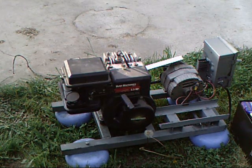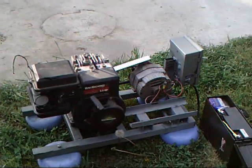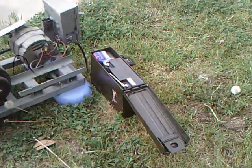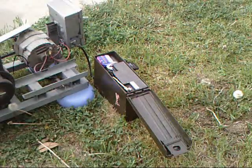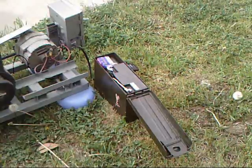Pretty basic. As you can see there, I've got a GM — I believe it's called a three-wire alternator — that came off my old Chevy Suburban. Nothing too exciting there; the wiring harness is pretty simple. On the other side I've got a little control box, and right there I have my battery, which is the power source to energize the alternator as well as the power source to use when the generator is not running. This particular type of generator requires you to energize the field windings before it's going to produce any juice.